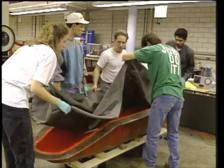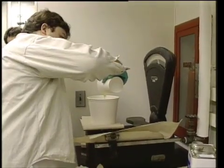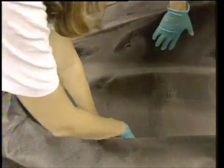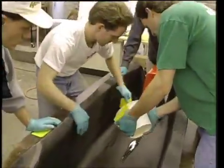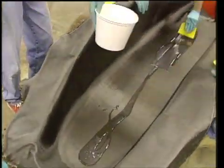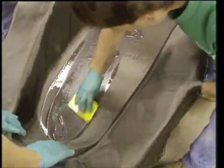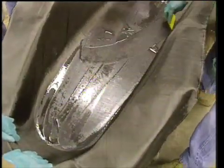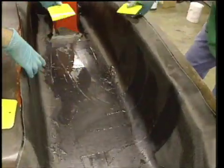To begin the layup of the outer skin of the bottom shell, we assembled the first four pre-cut layers of carbon fiber near the fabrication area. The first layer was placed into the mold dry so it could be accurately positioned before applying any resin. While we were placing the fabric, another student was mixing the epoxy. As soon as the epoxy was mixed, we had to become aware of the time. We knew that the resin would want to pull to the bottom. I had decided not to apply a surface coat and instead allowed the resin to saturate the graphite from the top. We would be vacuum bagging out the excess resin and believed we could adequately saturate this surface layer without a surface coat. We still didn't want any dry spots, and I was more concerned that we would not get enough resin into this layer or that we would trap air pockets.